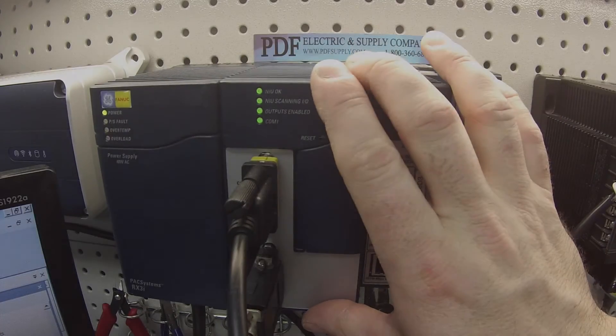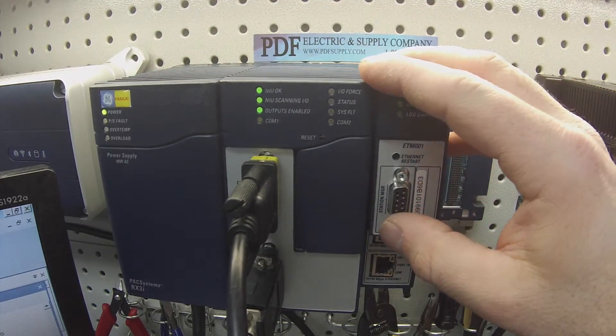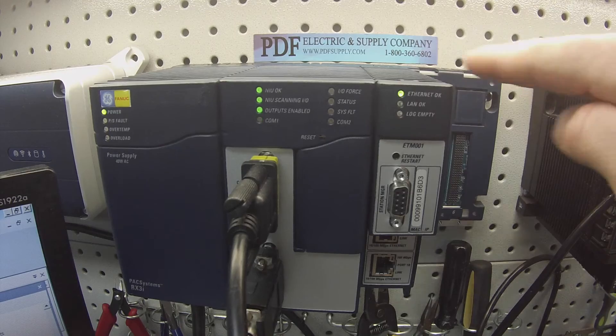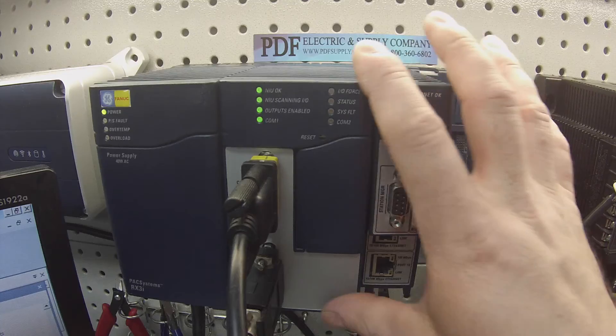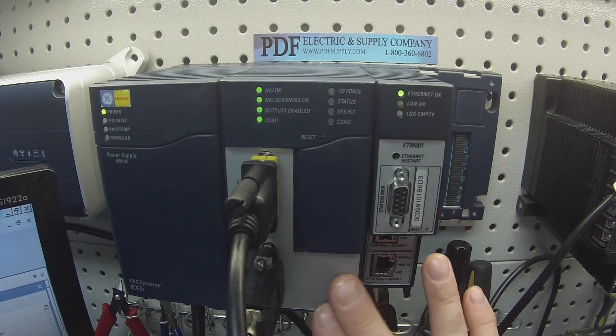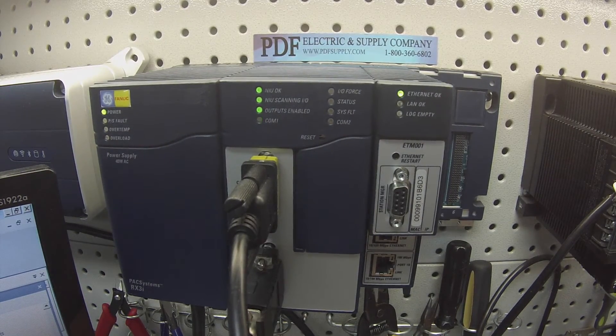Now that I'm in run mode, if you've gotten this far and you're pretty confident, I'd still suggest leaving it running for a few days over a weekend. Maybe add a couple of modules to create a little less heat escape so it's under load, putting it in a situation closer to a real working environment — that gives you a better feel for whether it has deeper problems. If it fails to stay in run mode, look at the fault viewer table first to see where and why it's failing. Sometimes the error code is hard to interpret, and in those cases this is something we would normally repair here at PDF Supply. We offer exchange programs, new and remanufactured products, and same-day shipping. If that interests you, please see us at PDFsupply.com. Thank you.